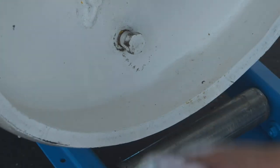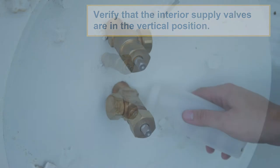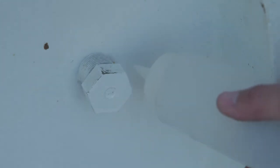Before loading the chlorine ton cylinder into the vessel, wipe any water off the cylinder and chime with a cloth. Remove the protective valve bonnet from the cylinder and verify that the interior supply valves are in the vertical position. Use an ammonia wick to test all fittings and valves on the cylinder for leaks, including the fuse plugs at the rear of the cylinder.